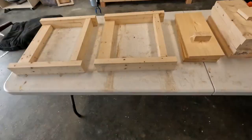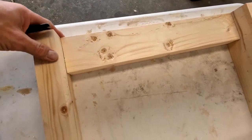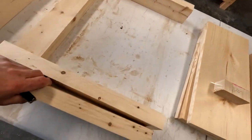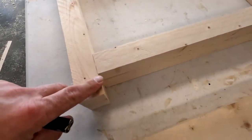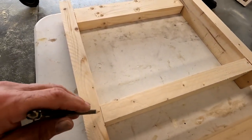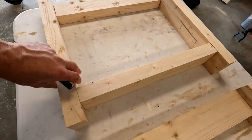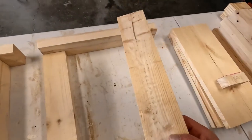I've mocked my two sides up. This is the side top — I've got one board laying flat so it faces outward, and the other board turned up on its side to make the bottom support. We've done that with both sides. This is a situation where your side and your leg are almost the same, so make sure you don't mix them up. I want to measure up about two inches on the inside — two inches here, two inches there — and mark the front two where the front boards will attach. You can make this two, four, or one inch, or flat to the floor. I'll give it two inches off the floor.